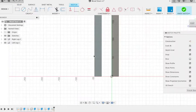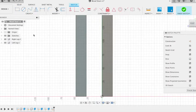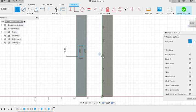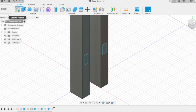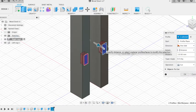Next we're going to add the mortises for our bottom rail. Using the grid we're going to find 75mm up from the bottom and draw a rectangle that is 5mm in from each side, 22 tall and 10 wide, and then do the same on both legs. You could do these separately but it makes sense to do them both at the same time. Once we've drawn those we can extrude those in 10mm, so minus 10, to create our mortises.